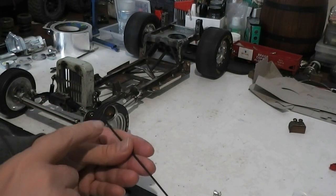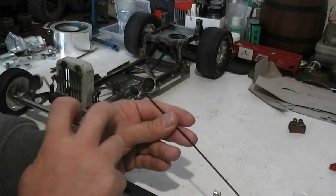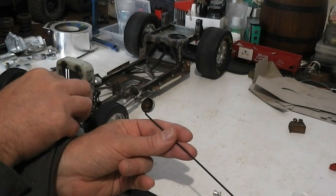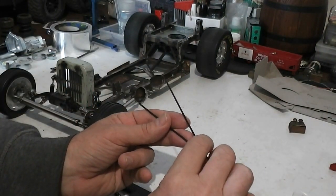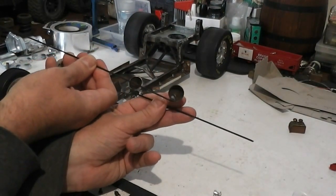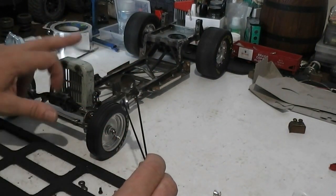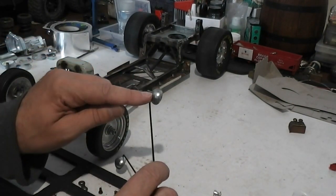What I did actually was I did one and then I did another one, and I put the wire in the same direction, so I ended up with two that were facing the same way, which was no bloody good because I had two for the same side of the radiator shell. So I did a third one with the wire around the correct direction. So now I've got two that go in opposite directions. So the next thing I'm going to do before I start the mounting stuff, before I forget, is I'm going to drill the hole in the back of the buckets here